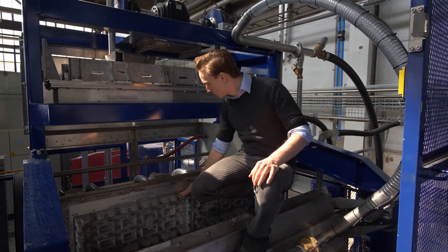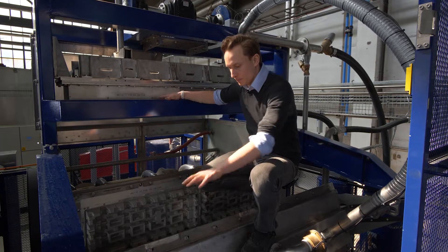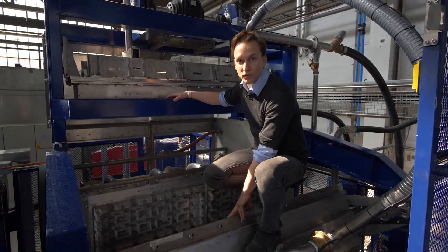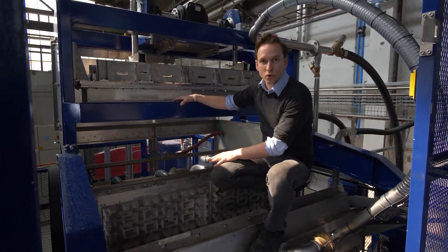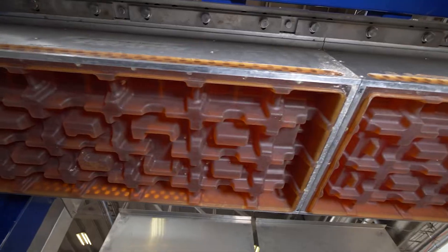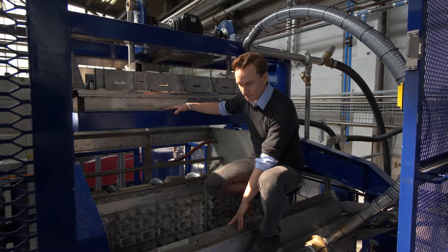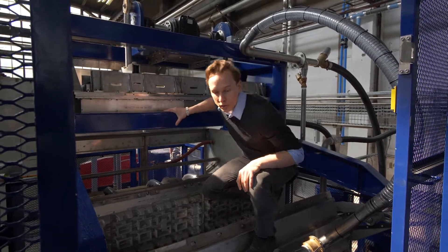Our tool mounting is complete. The two forming tools are in. We have the wet presses in place and I'm standing right on the transfer. This is the rotary machine with one face, so we have one forming tool. It is also with wet press which refines the shape. Here we have the transfer mechanism. So let's see how it works in motion.